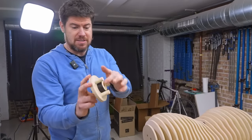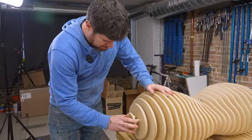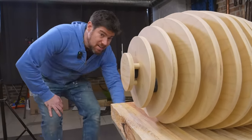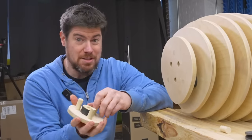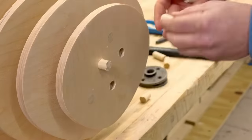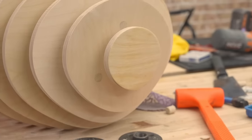For the end cap, we've got three dowels in here and one spacer, because there's not room for all three spacers around the dowels, and it should just slot right into these holes. Those dowels stick out like a sore thumb. Before we glue that in, I think we've got a plan — so you only see the little black spacers and keep that visual separation between all the segments. We're going to take some dowels, plug these holes, and use that to attach it, and I think that'll look a lot better.